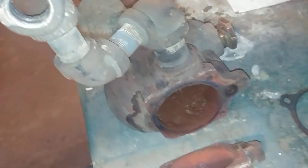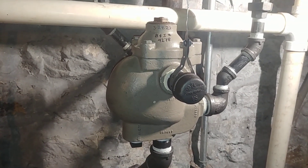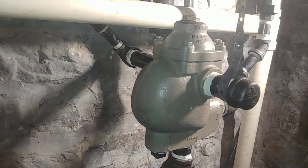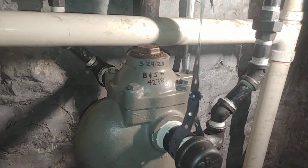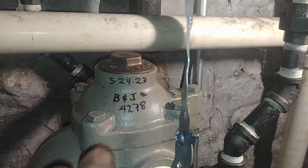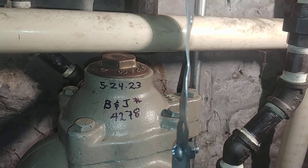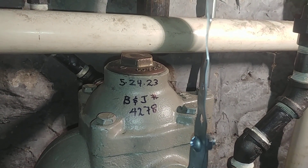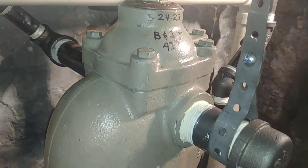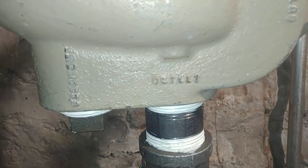So what did we put in its place? Another 026 trap. This one I got surplus, brand new. There is no vent top - this is a post-war unit, post-World War II. And the cage unit, the 4278, works best in there. The one listed in their book is not correct. These bolts have been removed, anti-seized, and put back. And there is a plug for the clean-out, there's your outlet, and then there is the other outlet.